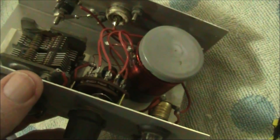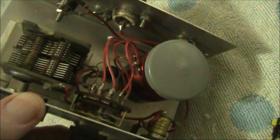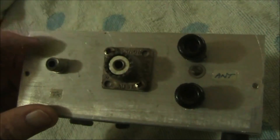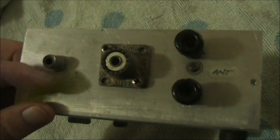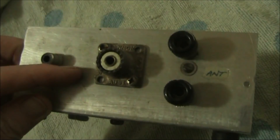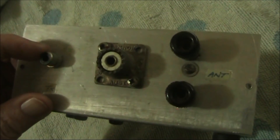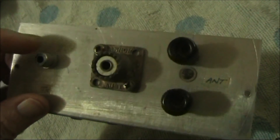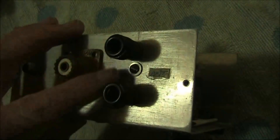This coil appears to work on all bands from 160m through to 10m. On the back panel are three connections for the transceiver — an RCA socket in parallel with the SO239. At that time, because they were cheaper, some of my homebrew rigs just used RCA connections, but these are in parallel. The two connections here are for the antenna.